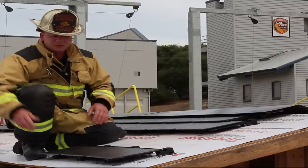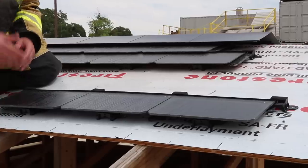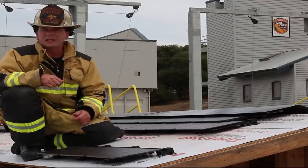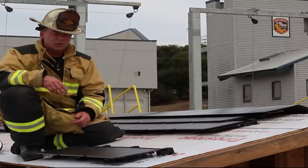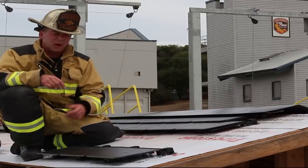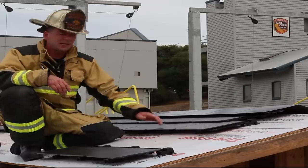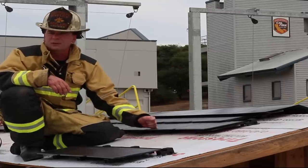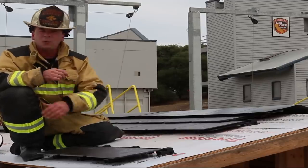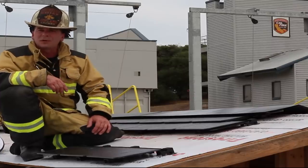If we want to remove the Tesla solar shingles, we can come down below the shingle and actually pry them up. We can then move the shingles out of the way with basically any tool. Papa's going to show you best practice for removing the solar shingles. One reason we'd want to remove the shingles is sounding — we're unable to sound a Tesla solar roof through the shingles. So if we're going to do any sounding on the roof or operate off of our ladder, we're going to need to pull the shingles in the area that we're walking or working to make sure that we've got a good roof underneath us.